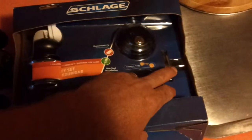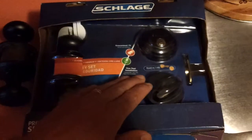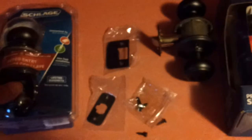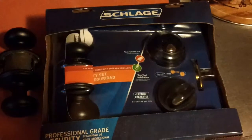The ones that go into the slide are what I would consider the critical ones. Now if you have a deadbolt, you're thinking the deadbolt goes deep into the door — there's your security. Well, no, it isn't, because it's only about a half inch of wood. When that buries in, it's actually keeping you safe. The deadbolt does look a lot more impressive, but it's a very little bit of wood keeping the bad guys out, even though you spend a lot more money and it looks like a lot more hardware on the door.